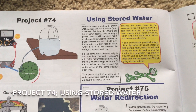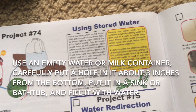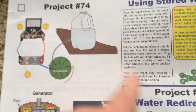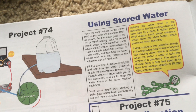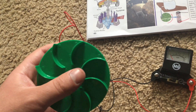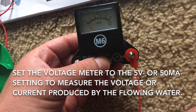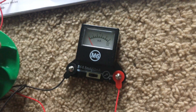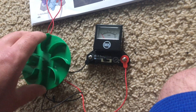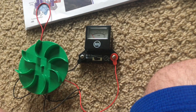Project 74 requires an empty plastic water or milk bottle. Fill it with water and carefully make a hole about three inches above the bottom, then place it in a sink or bathtub. Hold the water wheel next to the hole where water flows out so it spins counter clockwise. Set the voltage meter to the 5 volt or 50 milliamp setting and measure the voltage or current produced. Note that I cannot produce much power just by spinning the motor with one hand, but you would be holding the water wheel while the flowing water spins it.